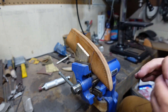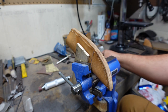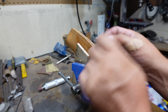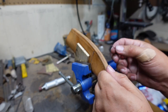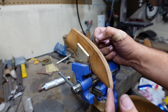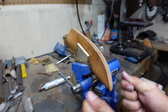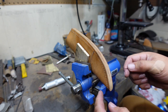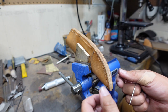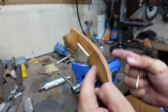I'm going to be doing the stitching and talking about knife profiles because I had somebody ask me a question about this. When it comes to the stitching, the number one thing somebody told me was how to actually do the stitch - it's got a little crossover thing. In the first two holes when I started this, I pulled my thread through to where it was even, then came through to the second hole, went back in the bottom hole, then back into the second hole and started my stitch. So it's doubled up on itself down here as the first stitch.